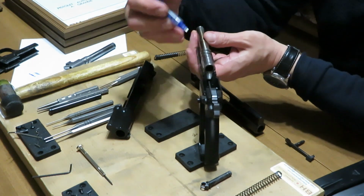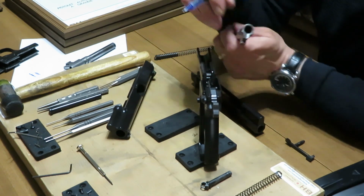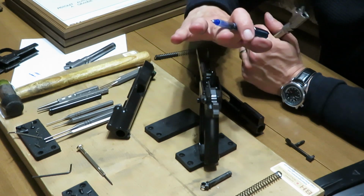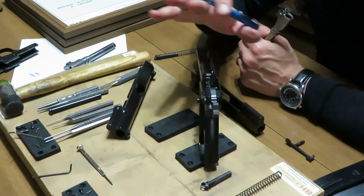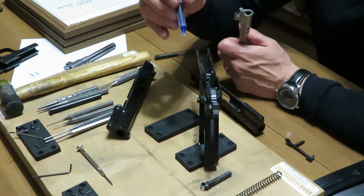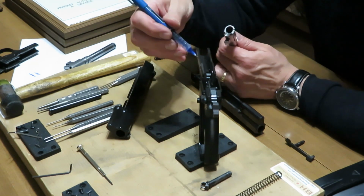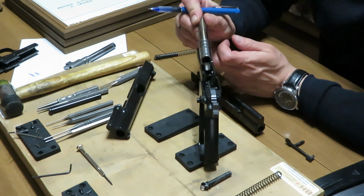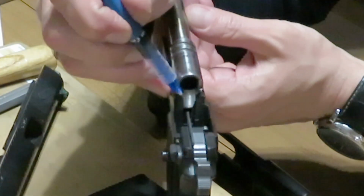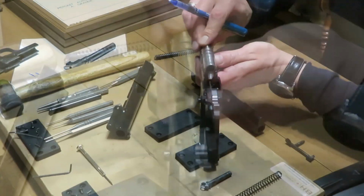Also, today, when someone with a classic high power like this one, they can use a BHSpringSolutions advanced barrel for high powers. However, you're going to need to approximately duplicate the relieving of this metal. And I'm no fan of removing any metal from frames and slides unless it's absolutely necessary, like if you're dovetailing sights in order for a superior sight upgrade to be installed. But this is one where if you want modern ability to feed blunt-nosed ammunition or hollow points, you need a straight feed ramp, and you need to mimic the later effort that FN did to relieve this edge back so it's not out ahead of the initial contact point of the feed ramp, and it needs to be done on both sides.